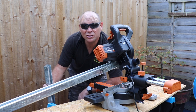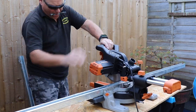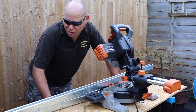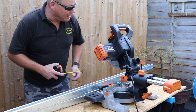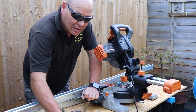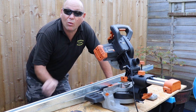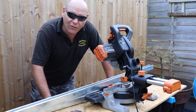For the braces that go across the bottom you've got to add the width of two pieces of Unistrut, which is 82mm - they're 41mm Unistrut. So I add 82mm, and my width was 500mm. Giving it 5mm tolerance and adding 82mm onto that gives 587mm. These measurements will all be different - I'll put what Unistrut and brackets I've used but I won't put the lengths in because all the tanks are different. If you're making your own you'd have to work out your own lengths. Mine is 587mm.